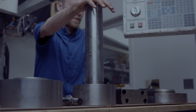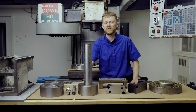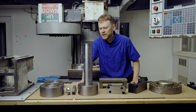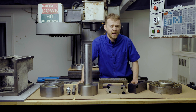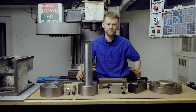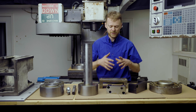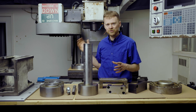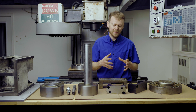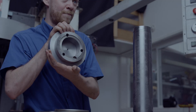This is a lathe test bar. This test bar is designed for an A26 spindle — that's going to be your SL20s, some SL10s, SL30s unless it's a big bore, ST10s, 20s, 30s. ST40s are going to be either A28 or big bore. So for history, you have an A25 spindle nose, and that's a spec not built by any machine tool manufacturer, but chuck manufacturers, draw tube people, and bearing people — everybody knows an A26 spindle is about that big.